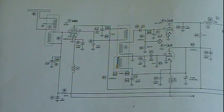So I can work out all my designs, all the parts and components and the wire lengths and everything. I can do all this design to match the maximum efficiency for the maximum gain of just that one frequency. And I can have two or three stages of amplification, or even four, and get a really, really strong signal going into the detector, and then, of course, from there on to the audio section, and driving a good-sized speaker with good sound, and being able to pick up a very weak radio station.